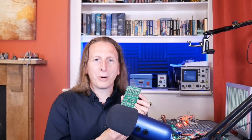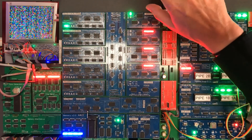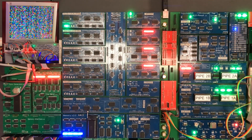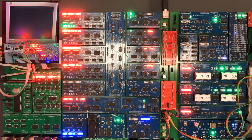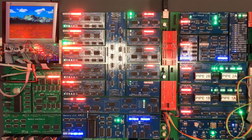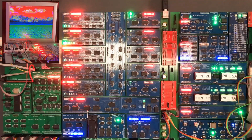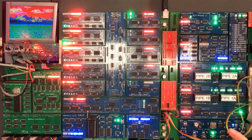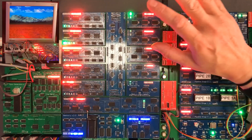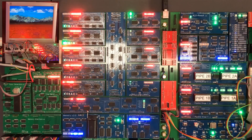So let's take a look at the initial problem. It's all up and running — we've got garbage on the screen at the moment because the RAM chip will initialize to complete random data, but if I allow the CPU to start running it should clear the screen. Let's fire up a demo. We can see this is working correctly but we also know these cables are the wrong way around. The colors still look right, but the memory write section wasn't actually the problem so the data in the RAM should be correct. Now we've reset it, the colors look correct again but the register writes are completely garbled, and that's what we need to modify the circuit for.